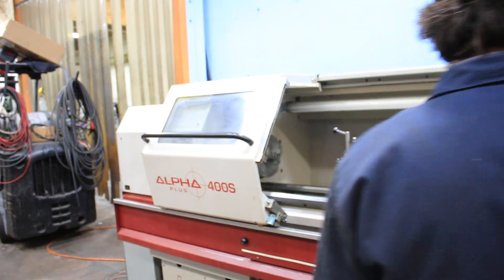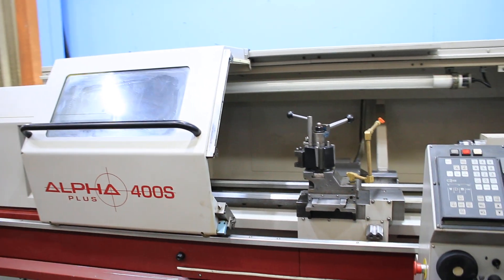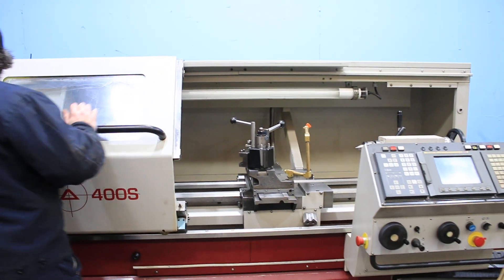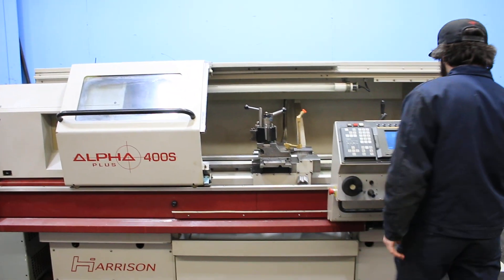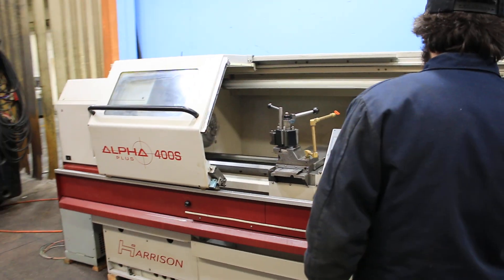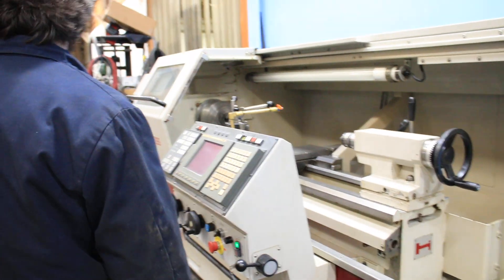You can also see you have a quick change tool post; we have holders with it. The machine also has a steady rest. High range — right now there's a six-jaw chuck on the machine. That's the high range, 600 RPM.